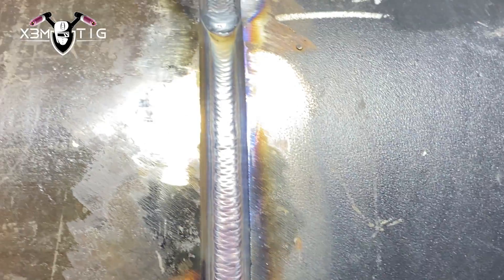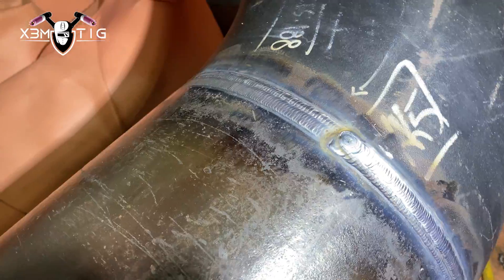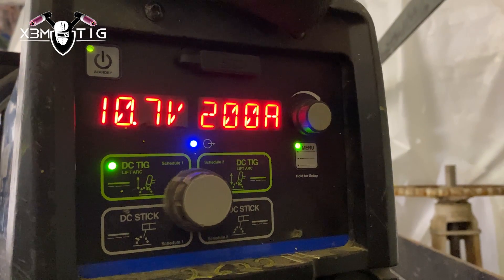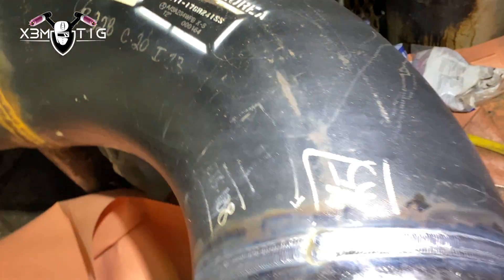That's gonna stay like that for the next shift — the next welder who's gonna finish both joints. Not much time left for me to end the shift. This side is filled to flush — two passes, 200 amps, and still the machine works very well. You can hear the fan a little bit louder now but it still works fine. That's it for this video guys — one joint is fill to flush, the other one is just a hot pass. Hope you like it and enjoy this real-life scenario. This is what we do, this is why it's good to be a TIG welder. As I said, burn to learn — there's no other way around it. That's the beauty of field welding. This is 12-inch extra strong, made in Korea. Subscribe, like, and see you in the next one — take care.